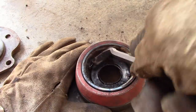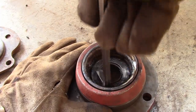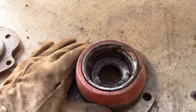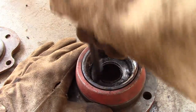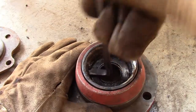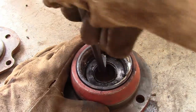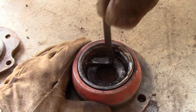So I don't know, maybe everybody already knows this trick, but I remember the first time I saw it when I was just a kid and it blew me away. It's kind of like the first time I ever saw somebody break a ball joint loose by hitting the side of the taper. Because, you know, logically, it looks like you ought to just hit the end of the thread and it should pop right loose. But if you've ever worked on ball joints, you know that's not true at all. Anyway, little things you pick up over the years.